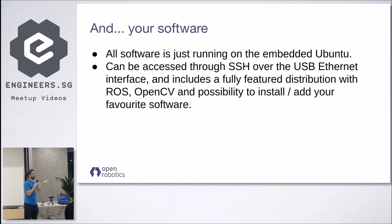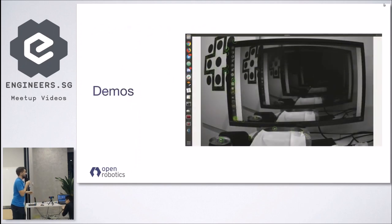What we used to do in my previous lab was push all the processing to the FPGA and leave to the ARM processor's onboard Ubuntu the higher-level tasks like decision making or navigation. It was quite simple to make a device — similar to this one — that is a fully self-contained computational module for robotics applications, which is very low power, very light, and very small.